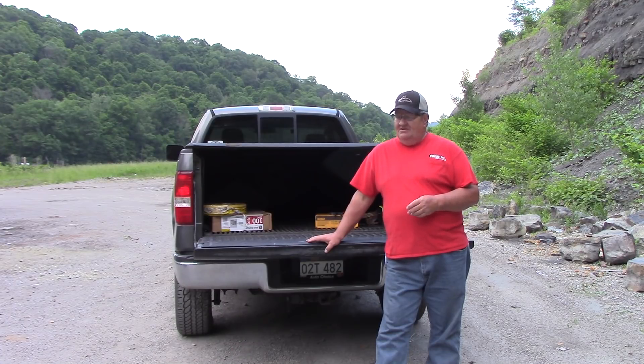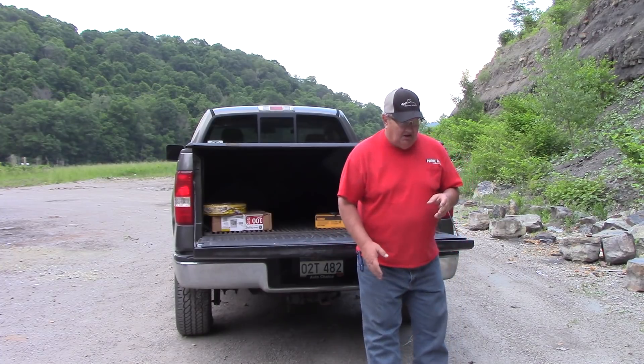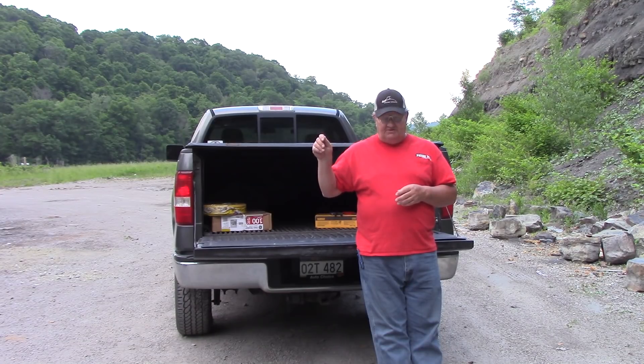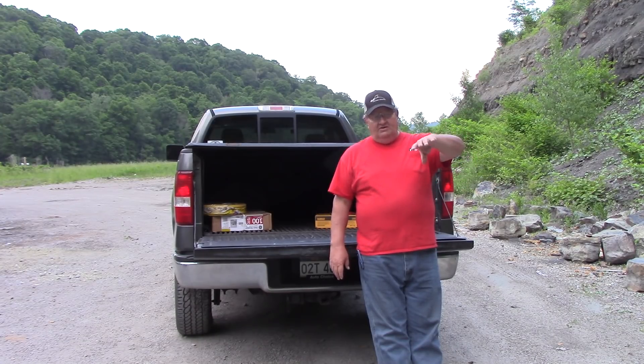Yes, I am. In fact, we're going out there tomorrow and I'll be running wiring for electric, putting in the service panel, and laying out my circuits that I'm going to run. I'm going to run three circuits — that's all I'm going to be using. One in the living room area for a couple of outlets and a light switch. One circuit will cover the bathroom and the loft.